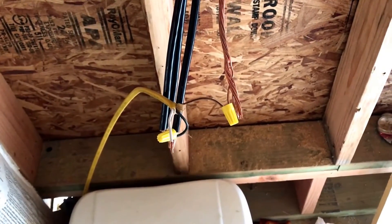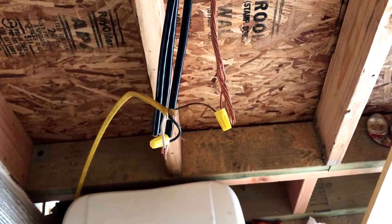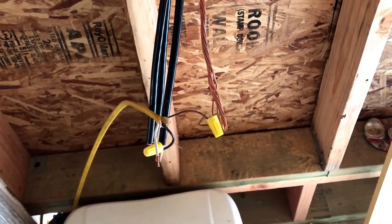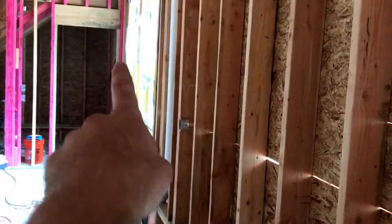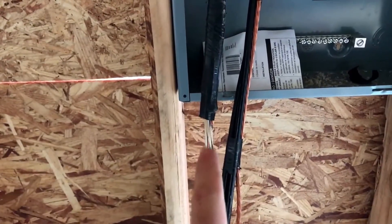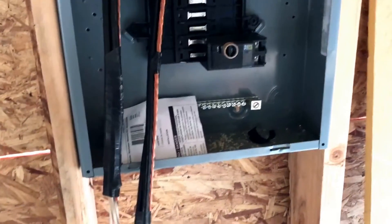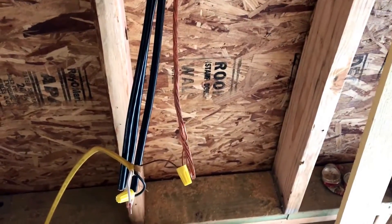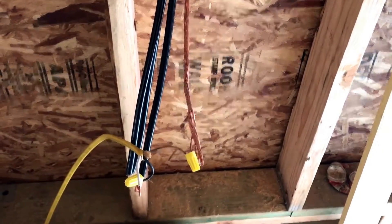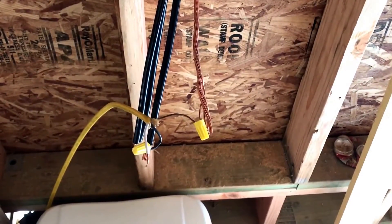I got lucky that the one I stripped is my first test wire — I had stripped the end of it upstairs when I was tinkering around trying to figure it out, and it's the right one. So I'm going to go ahead and hook this one in, mark it, and hook it in with the neutral lug as well, just so I remember for sure what it is. Then I'll have to do the same little test on the other wires. They go back over to the main panel over there, so I'll have to do the same test to figure out which one of the three black wires is essentially my big neutral. Happy I got this one figured out so I can wire this in. I'll test the other one real quick, and then my big main wires will run, and I can start running all the smaller wires for lighting circuits and receptacles. Just thought I'd show you guys how I figured that out — it was a stupid mistake, but easy to fix.